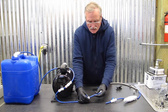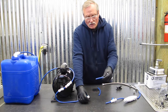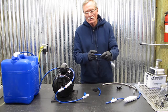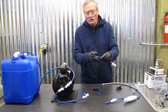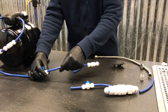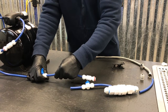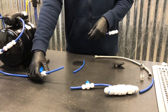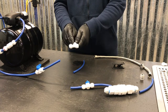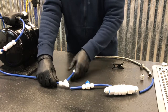With pre-cut sections of tubing to demonstrate how to make that connection — the John Guest tubing that you're going to be installing into the fittings seals against an O-ring. You want to make sure that your cuts of the tubing are 90 degrees and square, otherwise the tube will leak at the fitting. Press solidly into the fitting and you have a good seal. The next piece in our chain is going to be a 3/8 inch John Guest T.